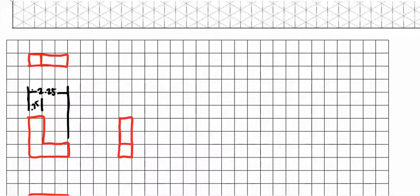Now what we're doing here is called datum dimensioning. Datum dimensioning, I'm going to keep going back to the left. You could do it from the right, but I'm going to keep going back to the left. Again, I started at the left, ran into a line, dimensioned it. Went back to the left, went until I ran into a different line, dimensioned it. Start at the left side.